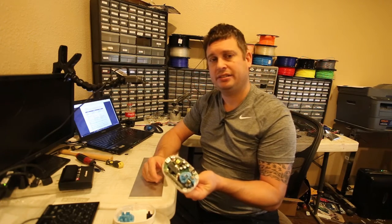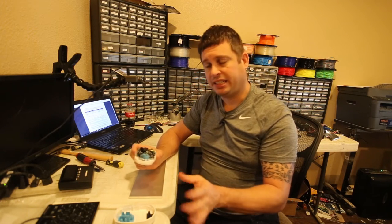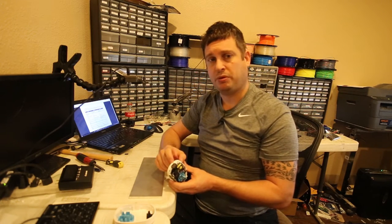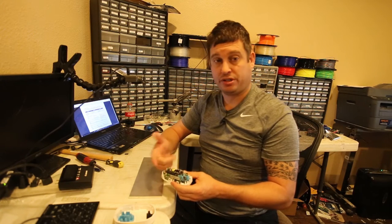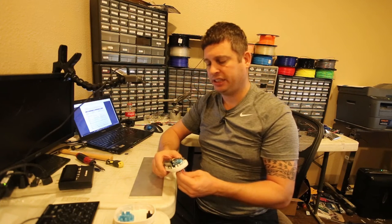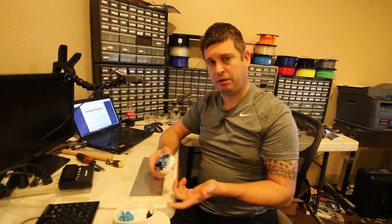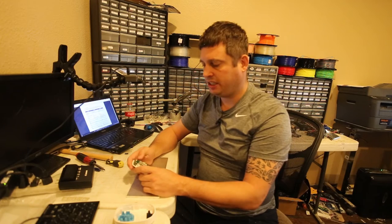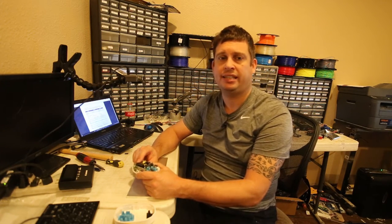There is no way you can make this for $5. It has a USB charging port rated for 1 amp, and it can switch on and off 110-volt power. I suspect this is a multi-voltage arrangement and that they probably make one of these for other countries. It uses a 16-amp, 240-volt relay that switches the hot leg of the power.